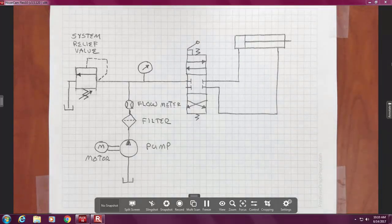Home plumbing, when do we use a reducer? Oh, we're just going to the ice cube machine. It has a different function. Otherwise, all your plumbing pipes are whatever size they are, one size throughout. They have a little different size, I think, for the bathroom and kitchen, but the washing machine and all that, all the main service is one size. And then trailers, they use a whole different volume, but they still have the same sort of thing. You won't really see a little half-inch line go to a 5-inch. When you go to the store and say, I'd like a quarter-inch or a half-inch pipe to go to 5-inch pipe, that just makes no sense. The only time you see little holes in pipes is like a quarter-inch tap for a pressure gauge, like a sense line. That's the only time you'll see a T with this little tiny quarter.